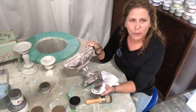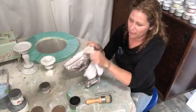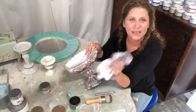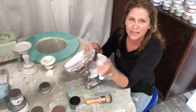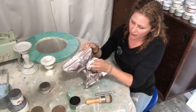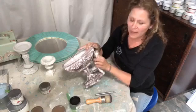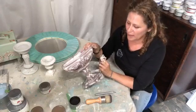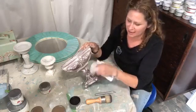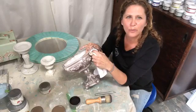So, if you want to put a piece out for a little while because it looks nice, and you're taking it from the inside of the house to outside, I want to be clear, yes, you can. But just to leave it outside, no. You know, the outside temperature and climate changes, and I don't know what other elements may be out there. It's never really a good idea to leave a piece that has been waxed outside. It's always going to need those special finishes for weatherproofing.